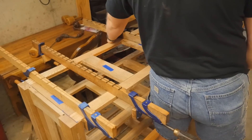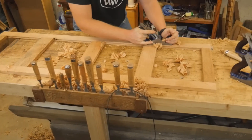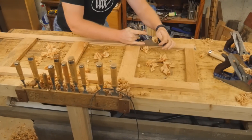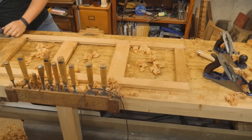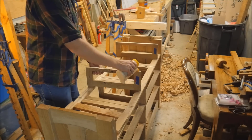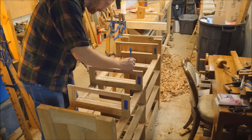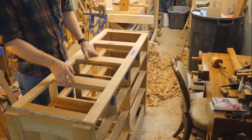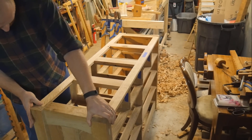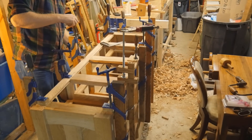I love these clamps — a true pleasure to work with, and I have a video on those if you're interested. Then my favorite: smoothing. I love smoothing curls. I smooth out the surface and bring it to the proper dimension so that it is ready for gluing. Then the final glue-up — this was probably one I thought would be very stressful, but in the end it worked out fairly well. The vertical drawer dividers sit in grooves in the shelf below and are going to be pinned into this top shelf we're making right now. I bring in all my favorite clamps and apply a little bit of pressure.